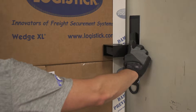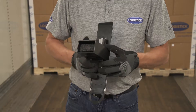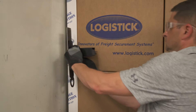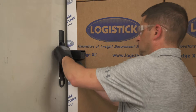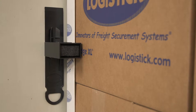Once the Logitrack is installed, it cannot be repositioned. Assemble Logitrack by sliding the pocket onto the track and locking onto the pegs. Remove the tape backing from one Logitrack. In a level manner, adhere the Logitrack onto the determined application area of one wall, making sure that the handle is pointed down to the floor and is positioned so the 2x3 will be in contact with the freight.